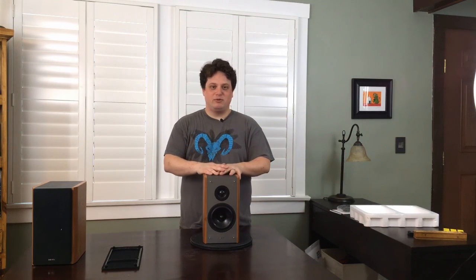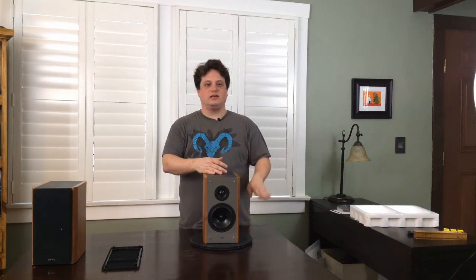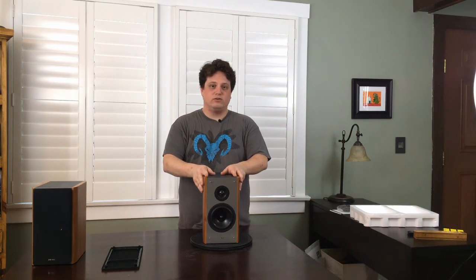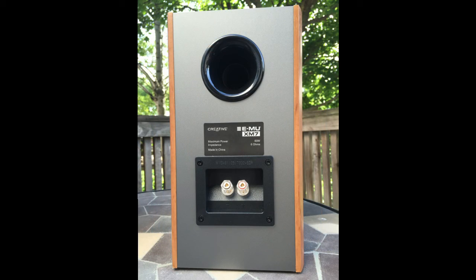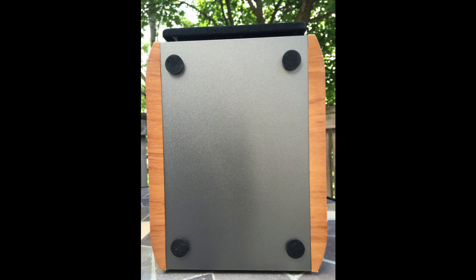Because speakers have many moving parts, they can benefit from a break-in period. How do you do this? Play them. Choose music with a wide dynamic range — a lot of highs, a lot of lows — and play it at a louder than normal volume. It takes anywhere from 8 to 50 hours to break them in, so be patient. Also, if you hook your speakers up to a receiver, you can use the receiver's test tone to break them in as well. The benefits of breaking in your speakers vary from a little bit to a whole lot, so you might not notice a drastic change. For more information on breaking in your speakers, see the links in the description below.